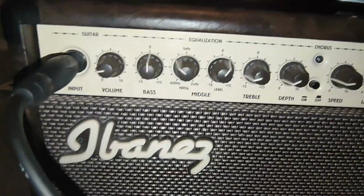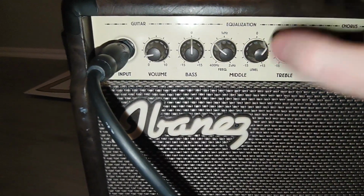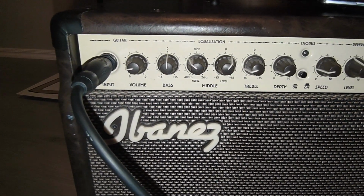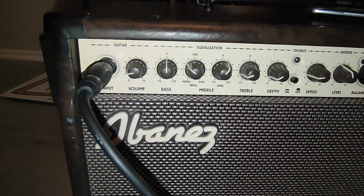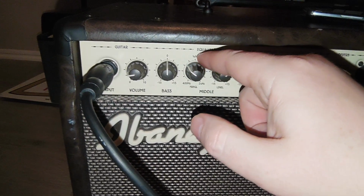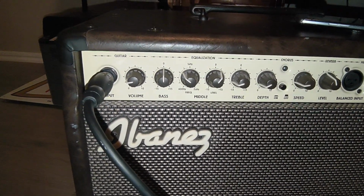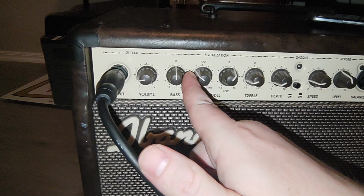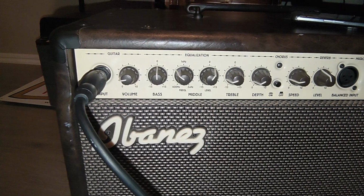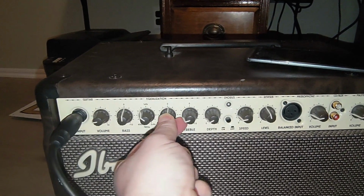So essentially this could be an issue inside this amplifier. Again, if I wanted to spend the time to refurbish the entire amplifier, that would be something I'm looking at, because I am sending in a 1 kHz signal, and when I have this selected for 1 kHz, I expect that's what I'm amplifying and attenuating. But in all honesty, 1000 Hertz is somewhere over here on this scale. Alright, but now we know where that 1 kHz is at.